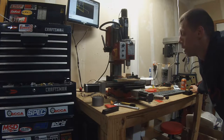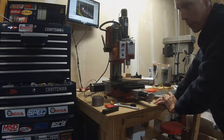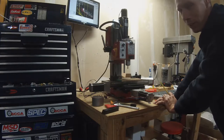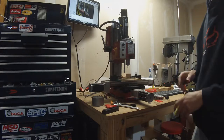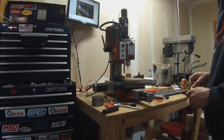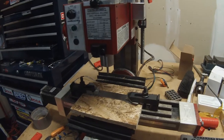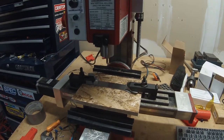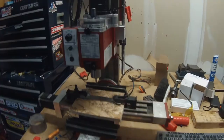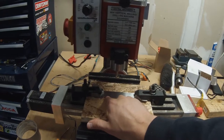Still going too far — how far is it gonna go? I'm really glad I ran this above the surface first because I was confident I was gonna hit go. Looking at it in the other direction, I think it's off in the Y direction as well, to where I'd be milling just the side of the piece. There you go, looks to be pretty safe now. Still not right though — I'm gonna go back and look at my CAM software tonight. It's still off-centered because the machining would go from there over to about there, so it should be a little more centered than that.